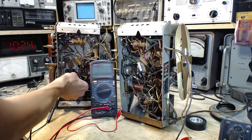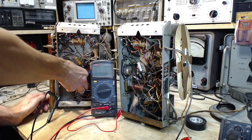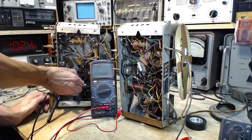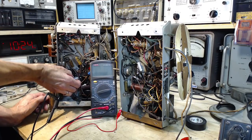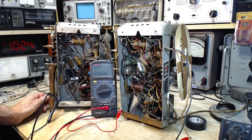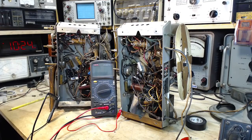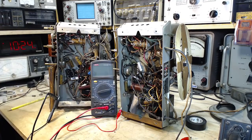And this one, see, it's a good thing I turned these radios off. Stick my fingers right in there. And if you rotate these, you ruin them. So I'm rotating it. 0.02. A nice looking capacitor. So we'll do a couple 0.02s in there. That'll be these two here. Away we go.